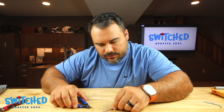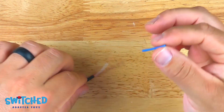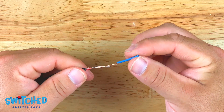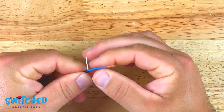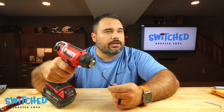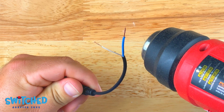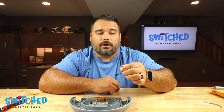Now we've got a bunch of exposed wire and we don't want it shorting out, so we need to put a little heat shrink wire cover on the red and copper wire, leaving just the tip exposed like on the white wire. I'll get some heat shrink wire cover and cut it to size, slip it over the wire, and get it all the way down nice and tight. Once we have the heat shrink on there, we use our heat gun — it takes just a little bit of heat and that wire cover will shrink down. If you didn't have heat shrink wire cover, you could also use electrical tape — that would be totally fine.